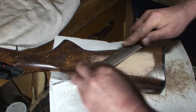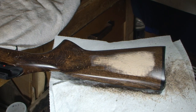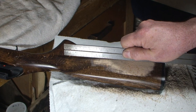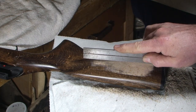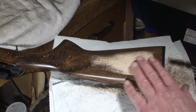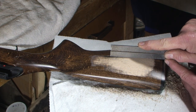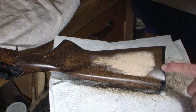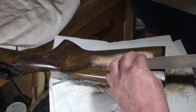You can see how big of an area that high spot was, and you can check while you're working — take your straight edge and check where we're getting. Far, far less wiggle now. There's no sense working into there yet; I'll probably work the flute a little bit before I get this perfectly flat. It's still very high up here — I've got at least 3/32 of an inch between the butt plate and my high spot. I'm going to blend that a little bit and work back here.